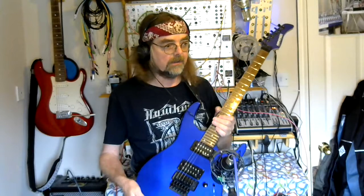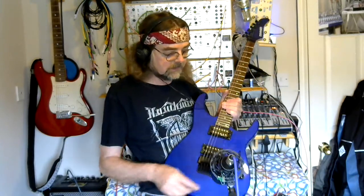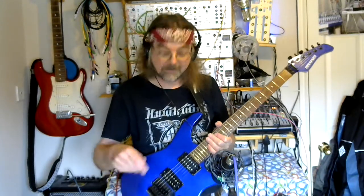Here we are then with hopefully the job completed. So I replaced the damaged switch, the sustain on and off switch, and replaced the battery connector as we saw earlier, that actually fell apart as well. And then while I was doing all that, a couple of wires broke away from where they were soldered on. I think it's just age, going a bit brittle, and the fact that I was moving the circuit board around, they gave in. So I've resoldered those back on, put it all back together, gave it a quick wipe down, and we're ready to go. So what does it actually sound like?